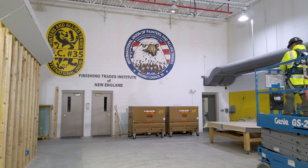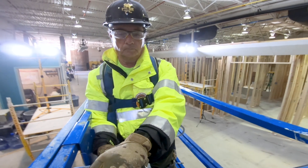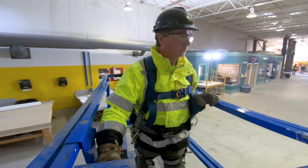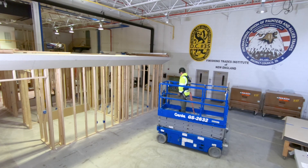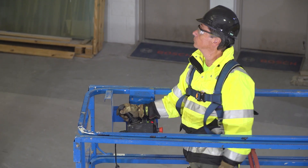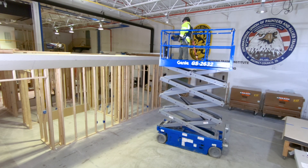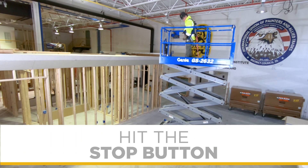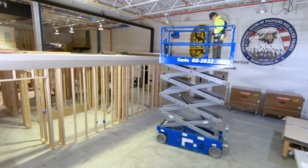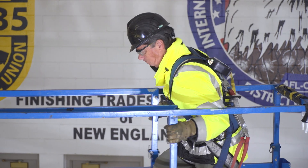Now you're ready to get to work. You've cleared the ground surface of the area where you'll move the machine, but continue to look all around as you move the lift into place — that means looking up, down, and all around. Verify every time you elevate the lift that there's nothing overhead you could hit. Once you get into position, it's good practice to hit the stop button and shut the machine off, so the controls can't be accidentally activated while you're working. Extend the platform to reach the desired location, and to elevate over objects or obstructions that are in the way.